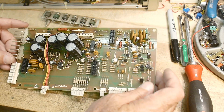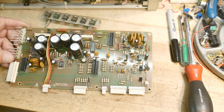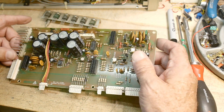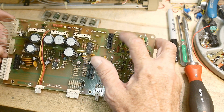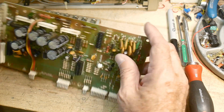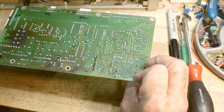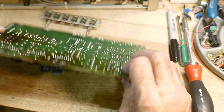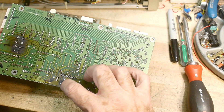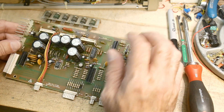I think this will be pretty easy to fix, if that's the only thing that's wrong with it. It could be that when this went down it blew up everything else. Makes me nervous that that resistor's missing — it's obviously been removed. That's never a good sign. And this component is not really soldered down very well — that's interesting, it's just a jumper.